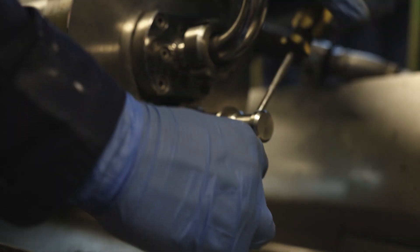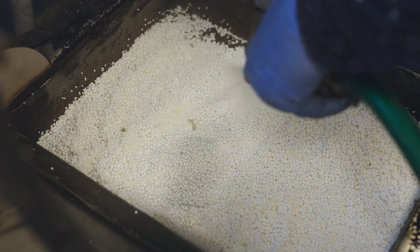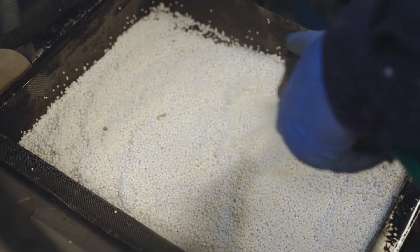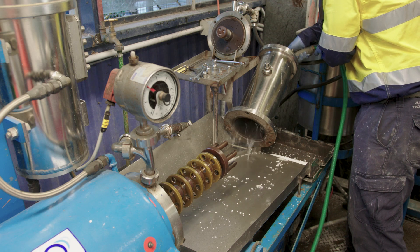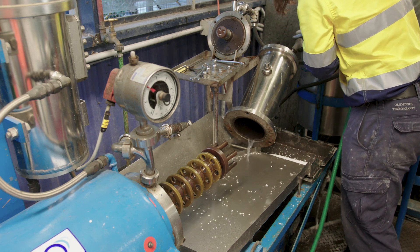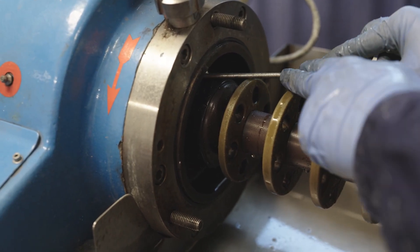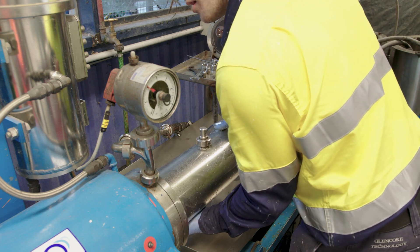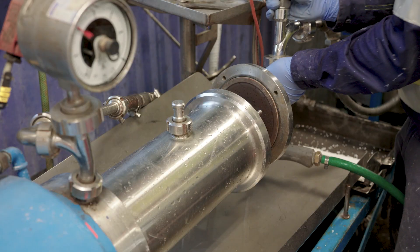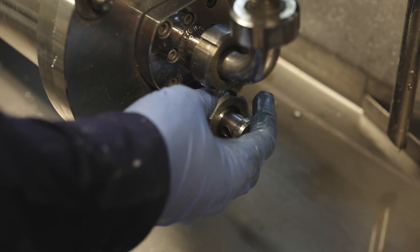Remove the scuttle plug on the M4 and begin draining the media from the M4. Isolate the mill and remove the shell to recover all of the media, then put the media into an oven to dry. Inspect and clean the internal components before reinstalling the shell onto the M4. Remove the isolation on the mill and complete another no-load power test for 10 minutes. This will allow you to assess the health of the mechanical seal. At the completion of the no-load power, pack away all wastes and tools used.